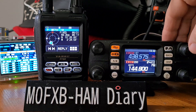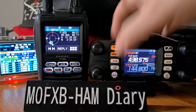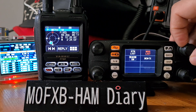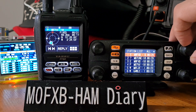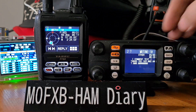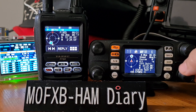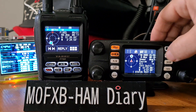On the FT5, hold the F button, go to APRS function, then look for lists — you've got Message List and Station List. Click Station List and push the button. For example, selecting MB7UNE gives a full screen but not much info. Selecting my own entry gives more detail, and you can scroll the knob to see more information.